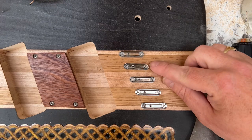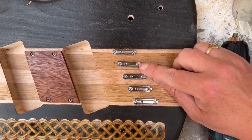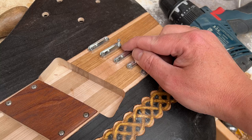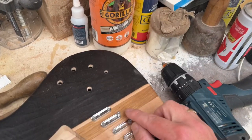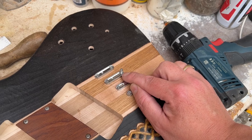Measure, measure, measure, measure — find out one of them's bloody wonky and then try and fix it. Looking down here we can see everything's looking lovely apart from this one: this hole slipped. So how are we going to sort that out? We're just going to take the screw out, move this out the way, fill the hole using sawdust and proper wood glue, wait till that goes off, and then re-drill the hole in the right place.